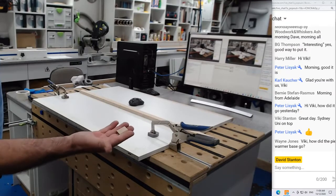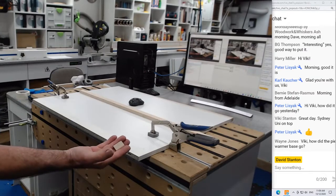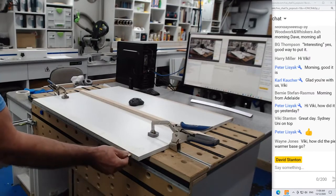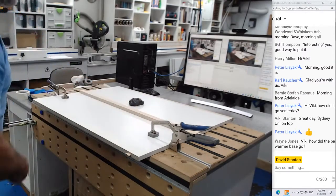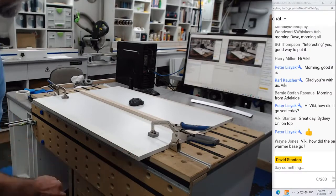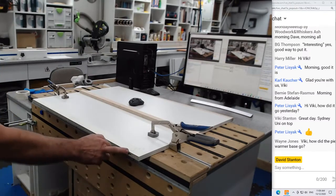Now, basically, for people that don't know what these are, a non-rotating dowel. That's all it is. They're made out of beech, and they go in there absolutely beautifully. So that'll go in 15 millimeters. I'm going to put receiving holes or mortises in that to go over it, and I'll make those ones a little wider. Okay, so this has been set at 8 millimeters deep because this is 16 millimeters.